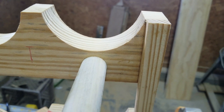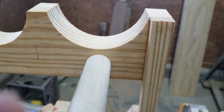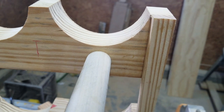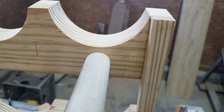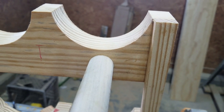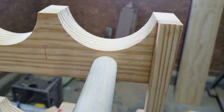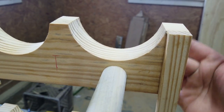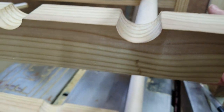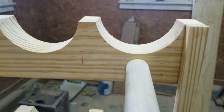And I didn't realize it till I started looking at it the next day, today. So what I'm gonna do, just to hold it in place when the glue joint eventually fails, and it will, it might be a year from now, it might be 10 years from now, depending on the humidity of where it's stored, is run some screws through the back end here, 2 screws on each level to hold it in place. I was just going to glue it until I started looking at it closer.